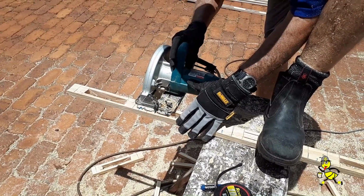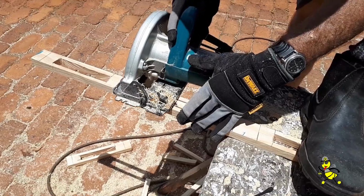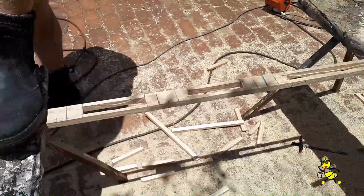We're now cutting the lids, ends, a little bit longer than what is required, and then they're trimmed off after the sheeting's put on so that there's no splitting of the timbers. It's a lot easier to do it this way than having split timber to contend with.